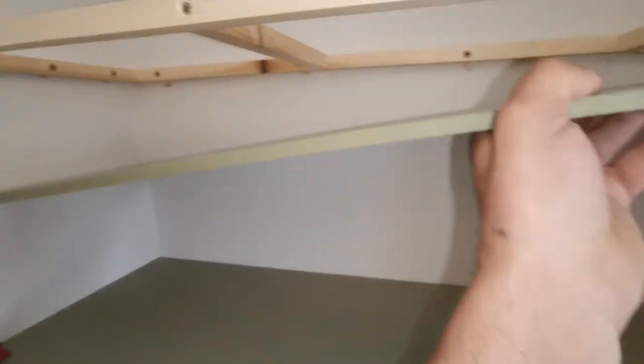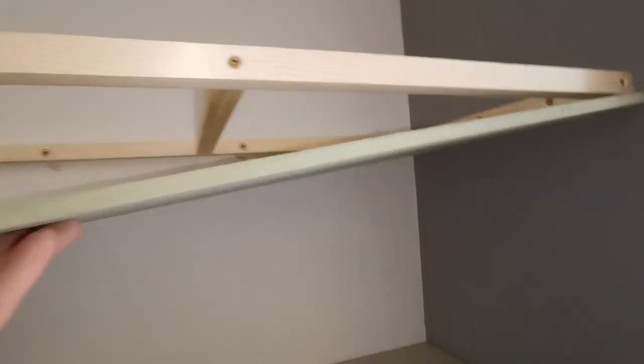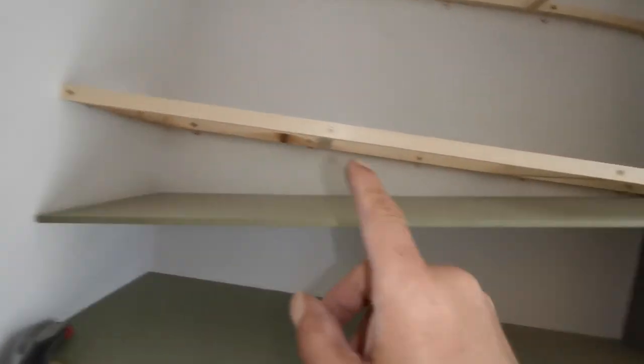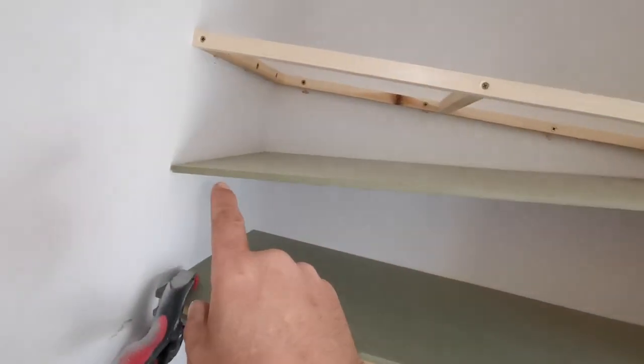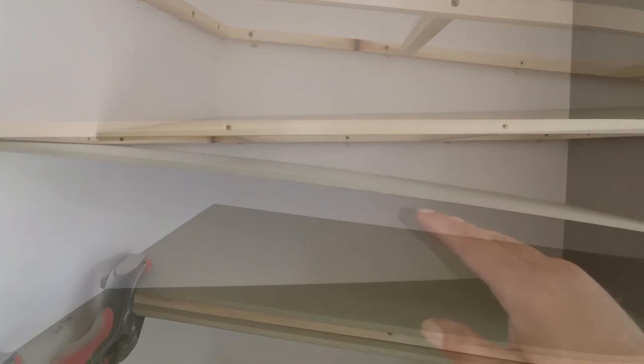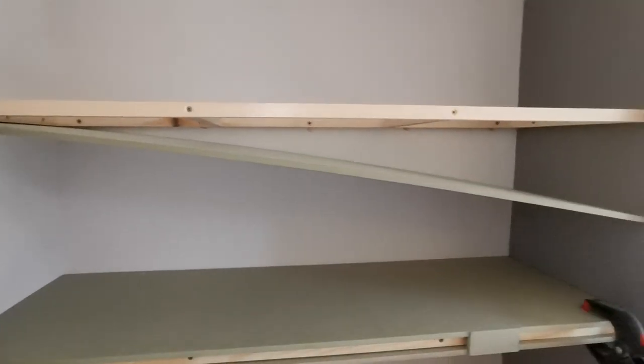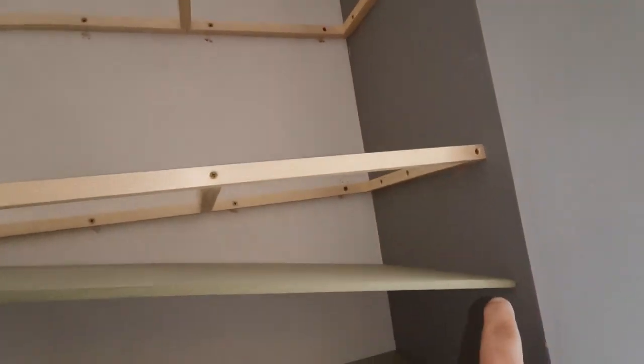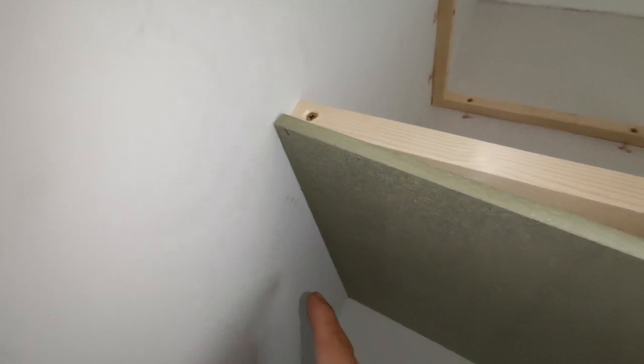I've got an X just to remind me which is that back corner. With one hand it fits fairly well. What I'll do now is measure across there and put a pencil mark from that distance onto here and scribe that end. I've just wedged it in for the camera, so I'll take that out and hold it up by hand. I've got my pencil mark there — that's that distance on there. I'll scribe that on it now.